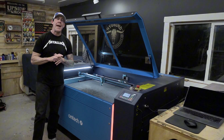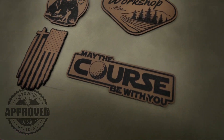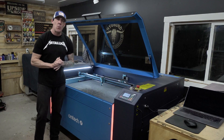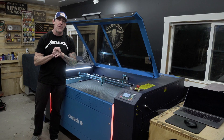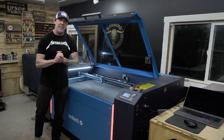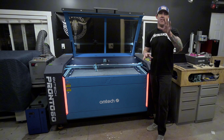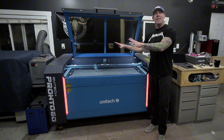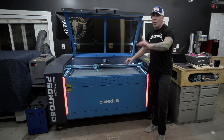Take a quick look at those patches. This Pronto 60 comes with a 130-watt laser tube — that is some phenomenal detail at only 325 LPI. A lot of times people think that having a much larger 130-watt laser tube means you cannot get fine detail, but if you wanted to enhance that detail even further, you could always change out your optics and adjust your focal length. Considering the large size of the work area on the Pronto 60, we mainly use this for vector cutting, but I've been very impressed with the detail you can get with the stock tube.